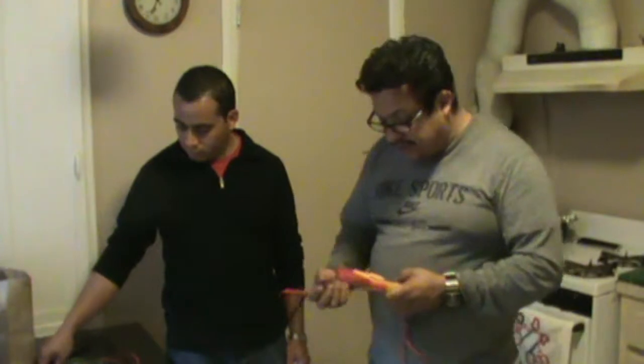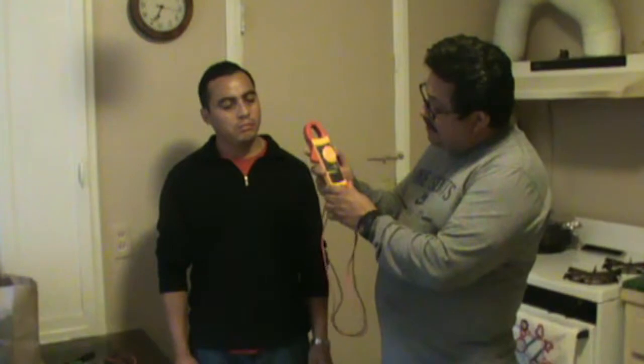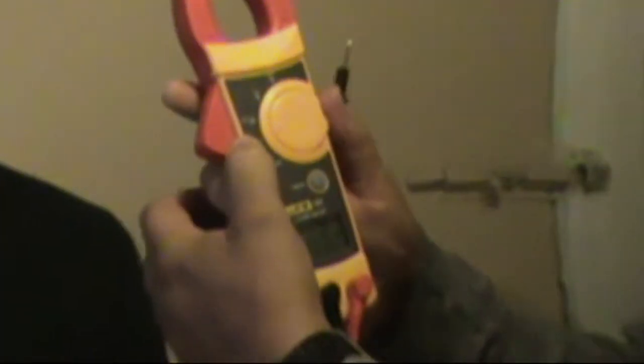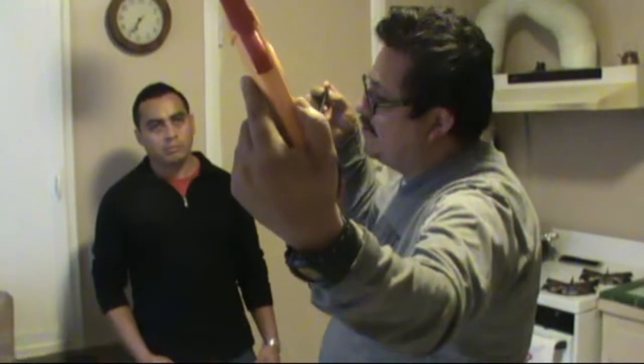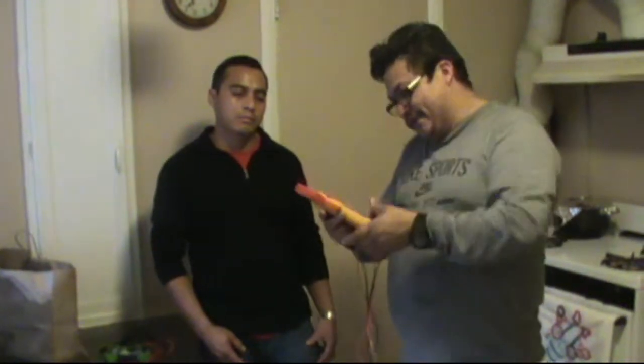Okay, when you need to check, I have my multimeter. It's very important that you test your multimeter when you start electrical work, because if it doesn't work and you work on a connection problem, you could cause a short circuit. When you check the multimeter, you see a little symbol, maybe a speaker sound or the ohms. You touch the probes together, like connecting a wire, and if you hear a little sound, it works. If there is no sound, it doesn't work, and you need to replace it or buy a new one. If it works, it's very good.